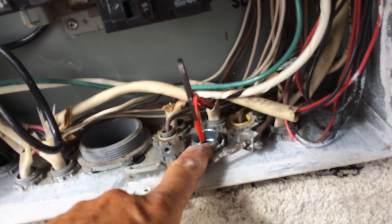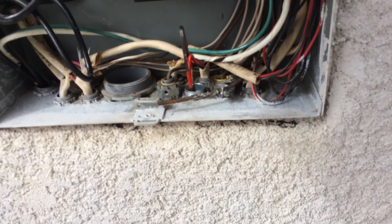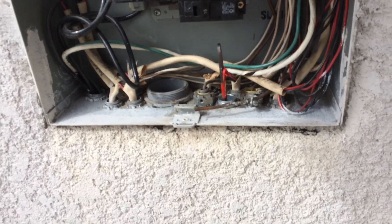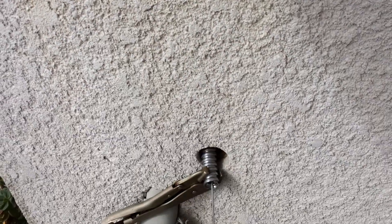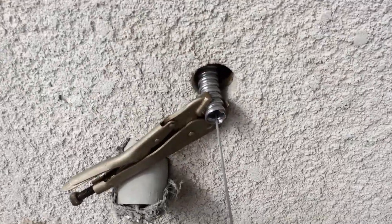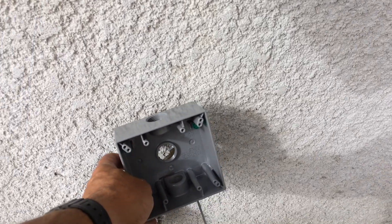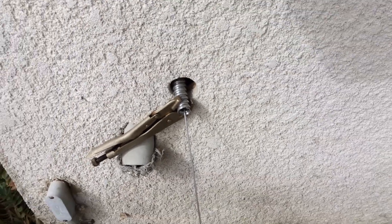This part worked — wasn't too bad. My hole's a bit big, but the head of the conduit is slightly bigger than three-quarters. I erred on the side of having too much room versus not enough, because I didn't know how tough this distance was going to be. The conduit has to make a hard bend, so the distance from the panel to the entry point needs to be fairly high. If you do have a big hole, it's not too bad — you just cover it up. And that's it for now.